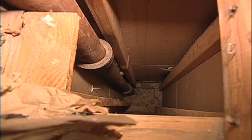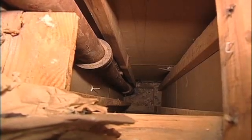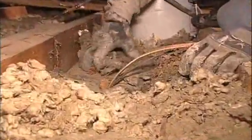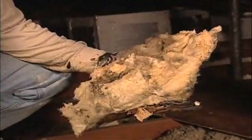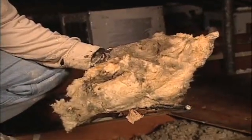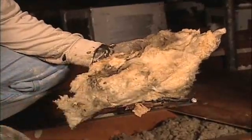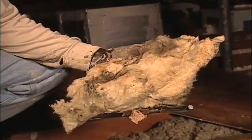You really have to look around for the areas that need to be air sealed. You'll often times have to move the client's possessions, move pieces of furniture, and pull back insulation. A good tip that I've come up with over the years is to inspect insulation for dirt. If you see dirt in your fiberglass insulation, this means you have some air sealing to do in that area.